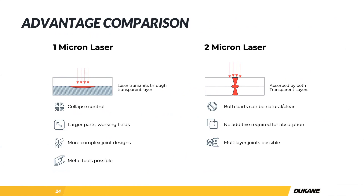A question we get a lot is whether there is a bonding agent that has to be applied in order to utilize laser welding. In this case, that's not the case — we do not need that. That said, it is an option. There are suppliers that provide specialized IR absorbers, which can be put into a solution like ethanol and pad-printed or painted onto the part. Rather than having an absorbing lower layer, you can create a pseudo absorption at the weld interface. We can achieve it without this most of the time — it's just an additional consumable that can be difficult to apply and adds a step prior to welding.